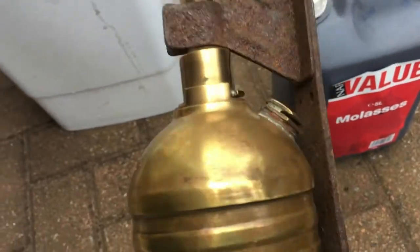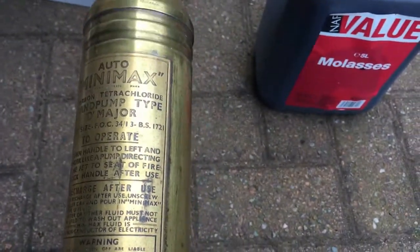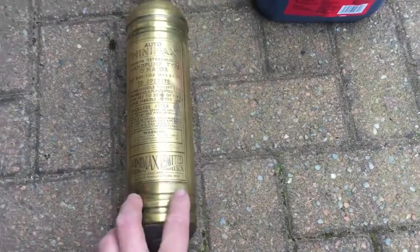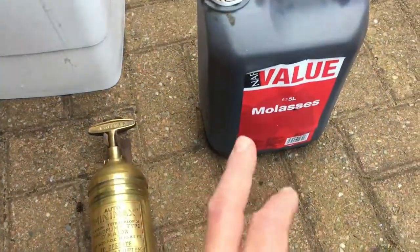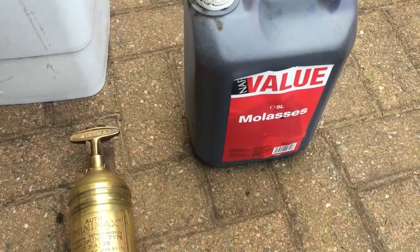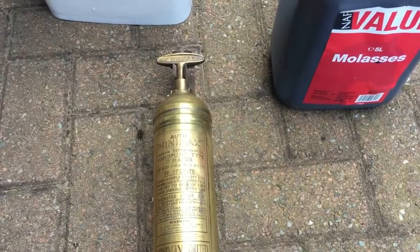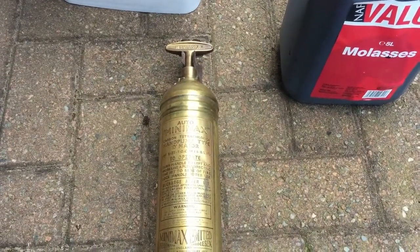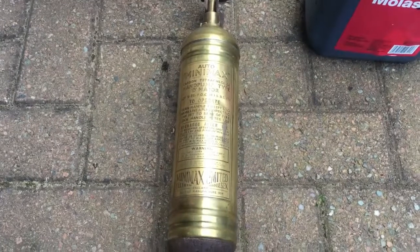...some nice patina on it, although the bracket that holds it out of the wall is obviously a bit rusty. So what I plan to do is just leave the unit as it is, but see about removing the rust from the bracket. It seems to just pop out, retained at the top as you'd expect. I'm going to try molasses — I believe the ratio is about one part molasses and about nine or so of water — and effectively just dip this for a week or fortnight. The natural action of molasses should aid and remove the rust, so a bit less abrasive than treating it with a wire brush or sandblasting.